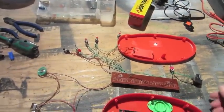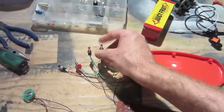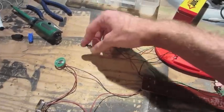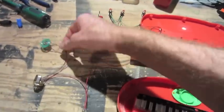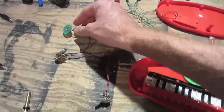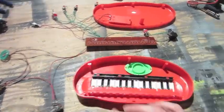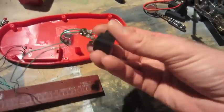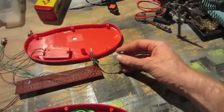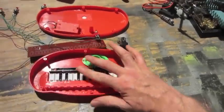I've got pretty much everything done. I've got my pitch bend here, demo mode, original piano, horn, a chord sound, and a reset. I wired the output to run to a quarter inch switching jack, so when you plug it in it cuts off the speaker. Both of those are controlled by the output pot. I did add a little trim pot here to limit it so it doesn't glitch out and freeze up. And now I'm going to start drilling holes and mounting everything in the case.